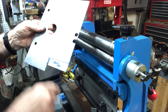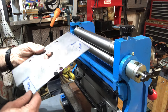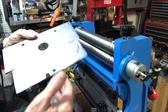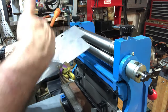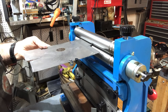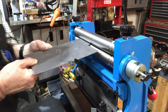What I was thinking originally was maybe I can stop the rolling, but it'll probably be easier to roll the whole thing and flatten those sections afterward. There are plenty of demonstrations about rollers on the internet. One big thing — since I've got the left tab here, if you have anything that's not perfectly symmetrical, make sure you have the inside part right. The machine is going to roll and put the curve this way, making a cylinder with this being the inside. So we need this to be upside down basically when we start it.